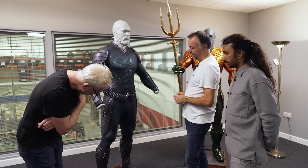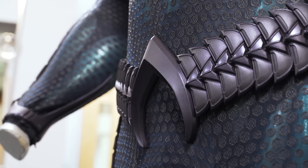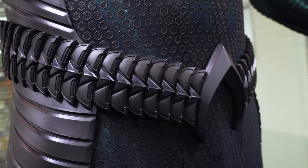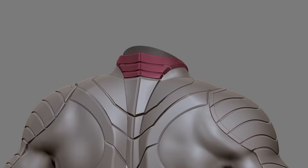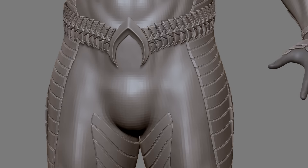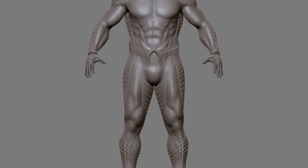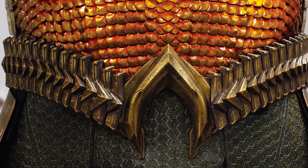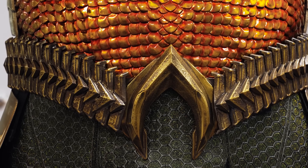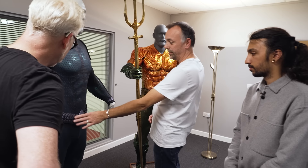It is absolutely gorgeous. These two are such a pair — it's not the same belt, it looks close but it's not. That one was made from scratch in a poly modeler, just sculpted it, refined it, and overlaid it so it all joined together, then printed the section, molded and cast it. This belt is a copy of the belt that was really on the first film. This one is more of a separate watch-strap kind of arrangement, whereas this one's part and parcel of the suit.